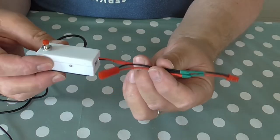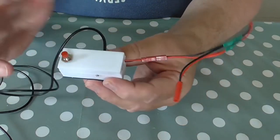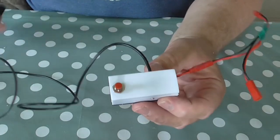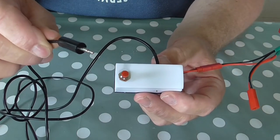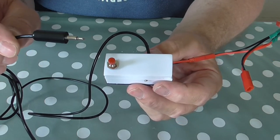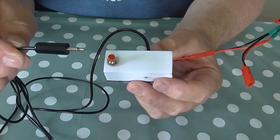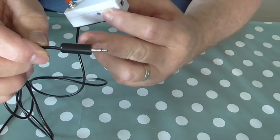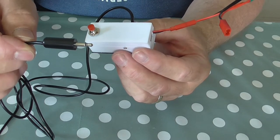I've done a wire lead so that the headset battery is tapped into to power the head tracker on the headset. The other end of this wire is your line input 3.5mm jack. It's not stereo on this — it's mono — so you only need a mono one. You can use a stereo but you just have to make sure you pick up the inner and the outer ports for it when you do.